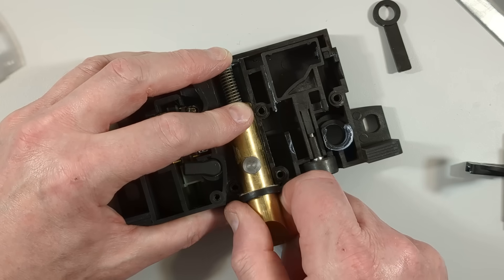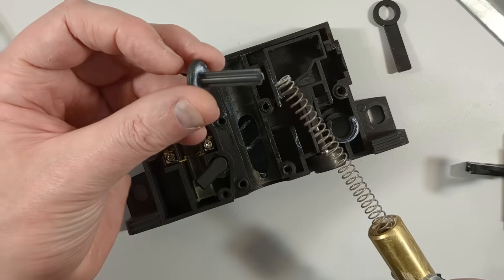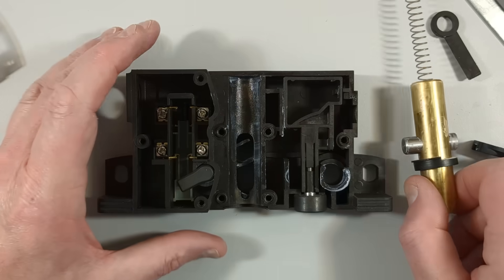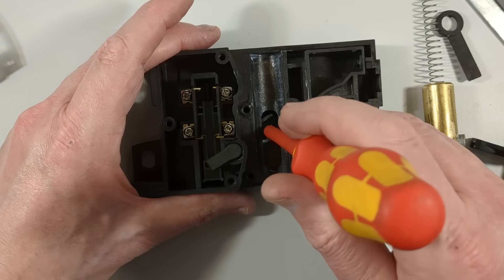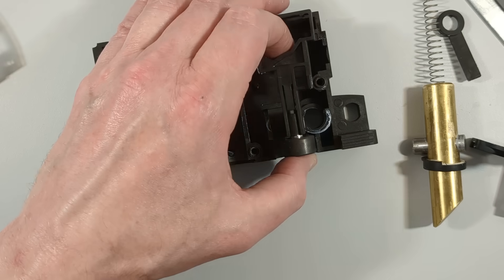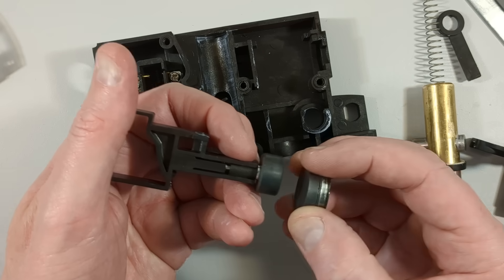The plunger itself has a spring that is very long and covered in grease — it took quite a long time to find it when it shot across the room. The bottom pin goes into the mechanism down there that operates the electrical contacts. If it doesn't drop down fully, it doesn't make the top contacts, but when it does drop down fully, it does make them. It looks fairly simple but it's not. This is the interesting bit: the magnetically actuated mechanism that slides up and down.